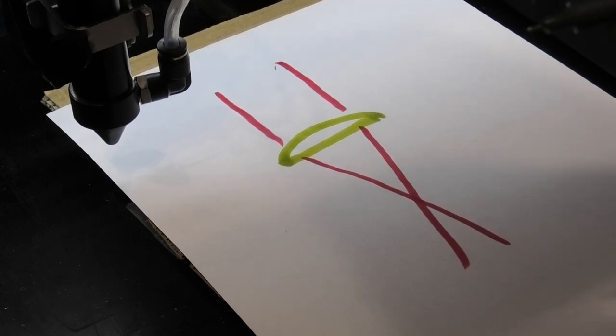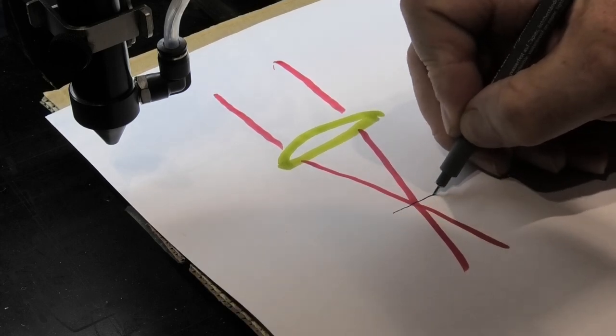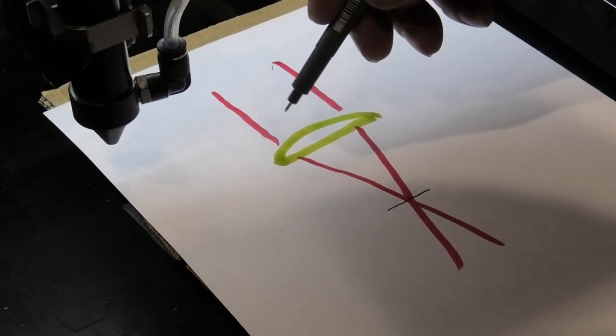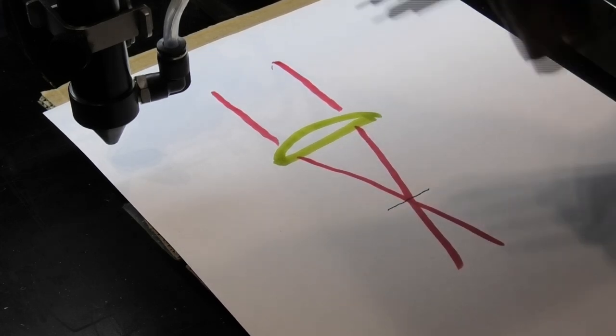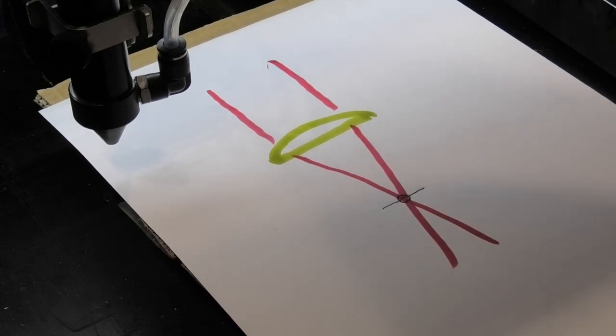A focal point is the point through which all the light rays pass. Just remember that. All the light rays pass. Which means that if I fire my laser beam at a piece of material and I get it spot on the focal point, then no matter how long I leave the laser beam on or what power I throw at the material, I shall always produce the same so-called spot size at that point there. It's the focal spot size that everybody talks about.